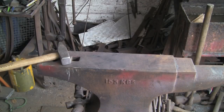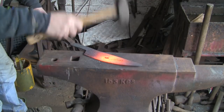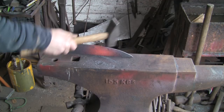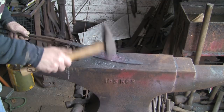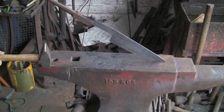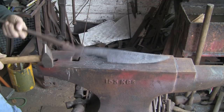Another heat - I might call it a day at this heat. Get this last one, thin it out a little bit more towards the blade edge and knock in a few more teeth. As you spread it at the bottom it sort of curves upwards, so you just need to straighten it out again. I'm going to call it a day at that, just make sure it's straight - get an eye down it and I think that'll just about do it. And that's it for forging. We're going to go over to the big grinder and try and define the shape.